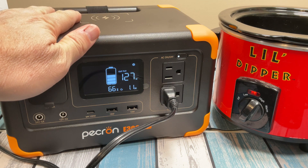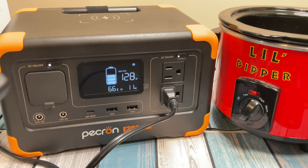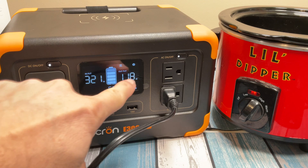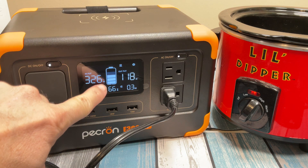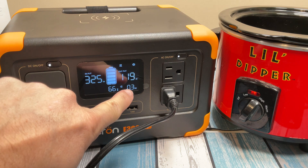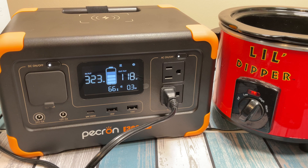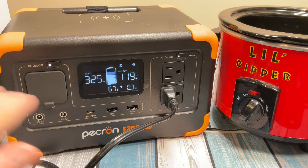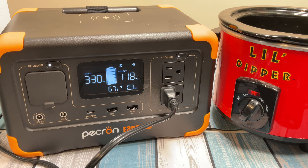While the battery is heating up the little dipper, I'm going to plug in the AC power adapter and see if we get pass-through charging. It took a couple seconds to ramp up, but now we've got 324 watts coming in from the wall and 118 watts going out. So now it is charging up, and instead of showing how long it can run, it shows how long it will take to fully charge — about 0.3 hours at this rate since we're giving it more power than we're drawing. There's also a UPS icon on screen: because it's plugged into the wall with something plugged into the AC ports, it's working in UPS mode. If we lost power, it would continue sending power to the little dipper, acting as a UPS.